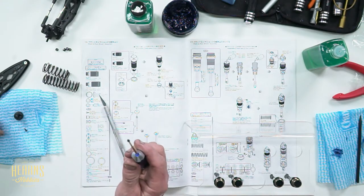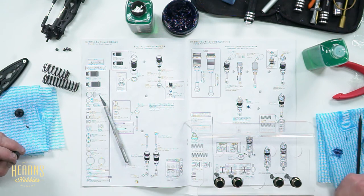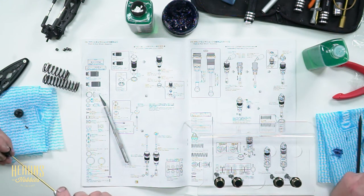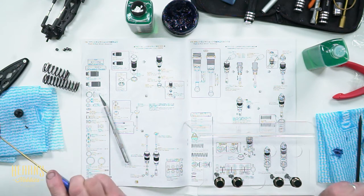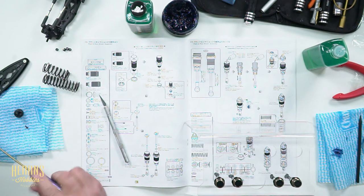What have we got here? What's going on now? That's a little screw. Yep, so we got the cap. All right. Rather than just ream it in dry, put a bit of oil on the screw and screw it in. It won't be so harsh on the thread. If it starts to get really sticky, listen, come back out. You don't want to balk it. No, you don't want to keep going and have it pick up the plastic and tear it. Cool, yeah. So just in and out a couple of times.